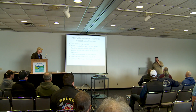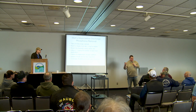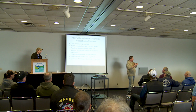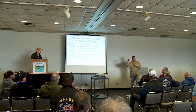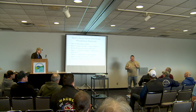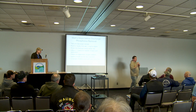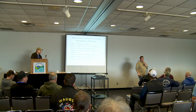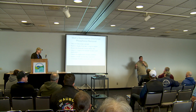I think where Matt's going with this is to try to figure out when you add your product, how much chemical do you need to buy? Obviously, it's quite expensive, so you don't want to overbuy, but you don't want to underbuy because you don't want to add twice. So what Matt's engineer has done is put together a really neat graph that basically states if Matt's total phos reading from the lab is 2.1 parts per million, he then can work up on his graph and figure out how many gallons of chemical he needs to purchase, which is pretty nice.